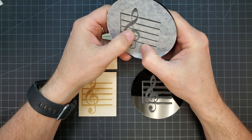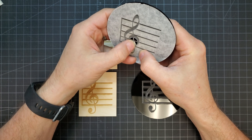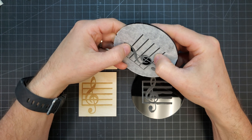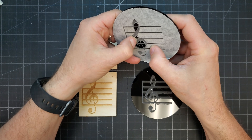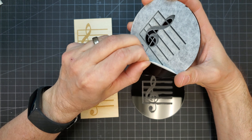After peeling the wood piece, the design looked really clean. There's still not a huge difference between the masked and unmasked pieces, but the differences you do see would be more pronounced the deeper the engraving went — in other words, the more burning on the surface, the more residue that would be left behind. This would also matter more depending on the wood being used; the more of an MDF core your material has, the more sticky residue that will be left behind.